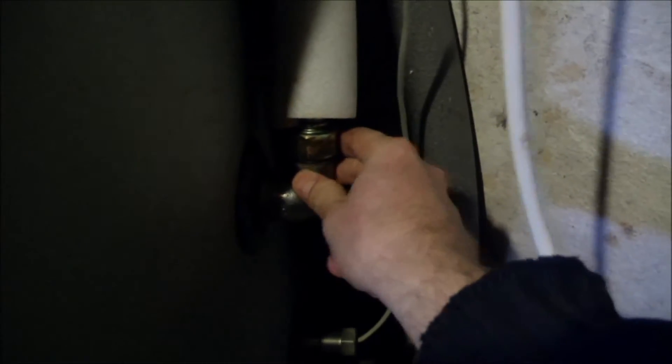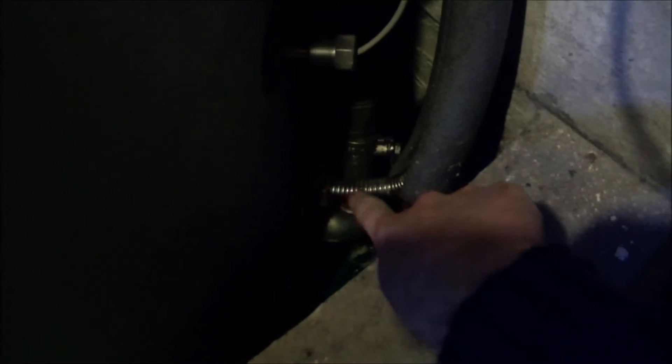This tank is prepared for all kinds of connections — there are a lot of cables in here. It's prepared for solar and for wood stoves or oil stoves, so it can run like three systems. This connection here is where the solar panels connect — that's the inlet. There's a spiral inside that transfers heat from the solar panels to the water inside, and it comes out again through this outlet.